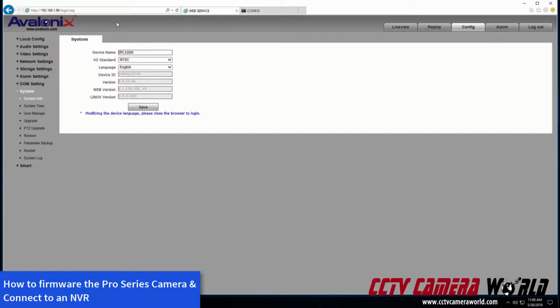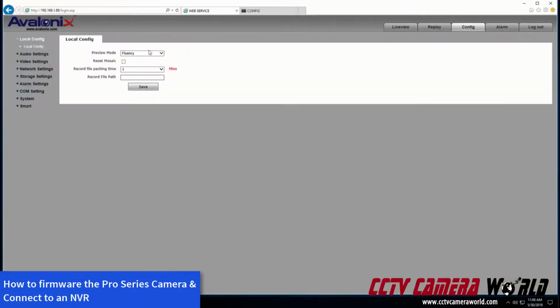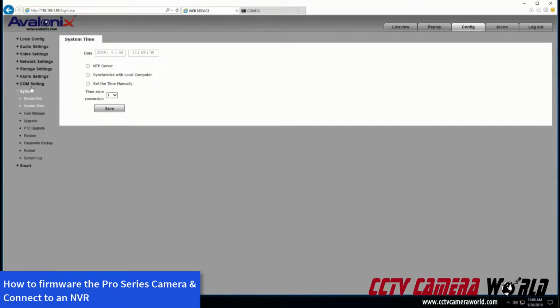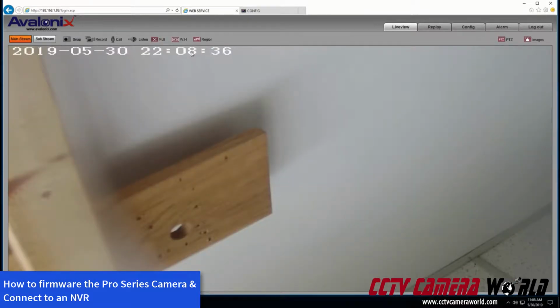I'll show you that here in live view. My time is 11:08 on it. I'm actually going to go into the config and set its time to be incorrect, just to show the level of sync our NVR and camera have together. So I'm going to set the time to be 22, hit save. Now go into live view, the time has changed to 22:08. In fact, it's 11:08.